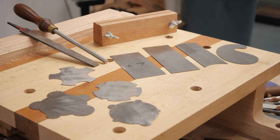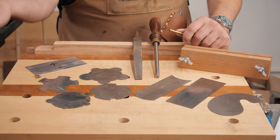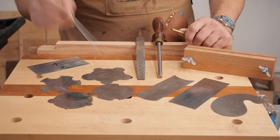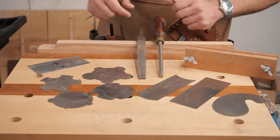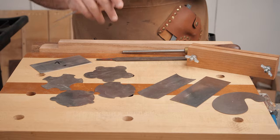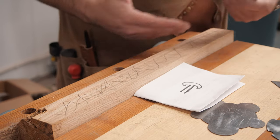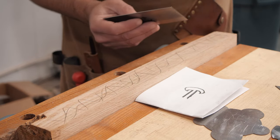I'm not going to talk about sharpening today because I just released a video on that — both videos are linked in the upper right-hand corner of your screen as well as a pinned comment and description. They are great sharpening how-to's. I'm going to talk about use today. A card scraper should be compared to a hand plane rather than a scraper because it is creating shavings, and if you're just getting dust you need to resharpen. You should be getting shaving-like material.